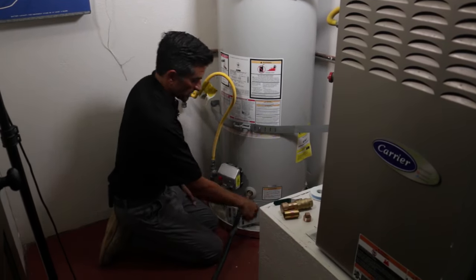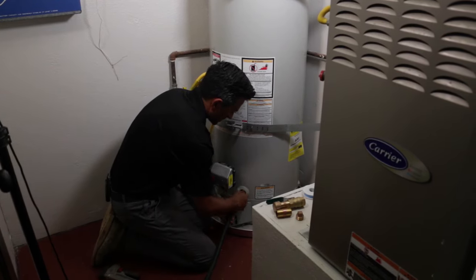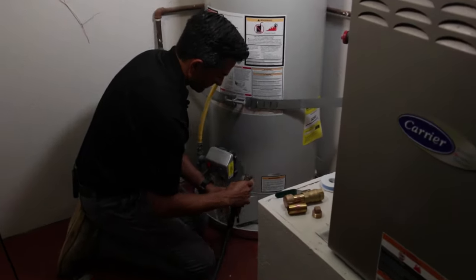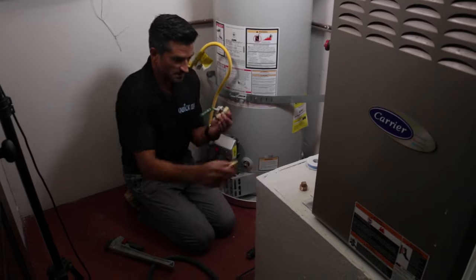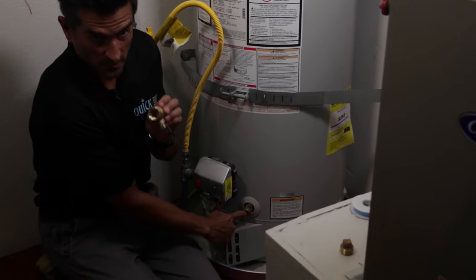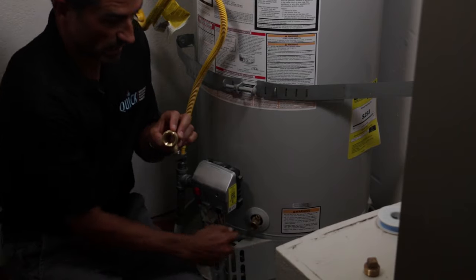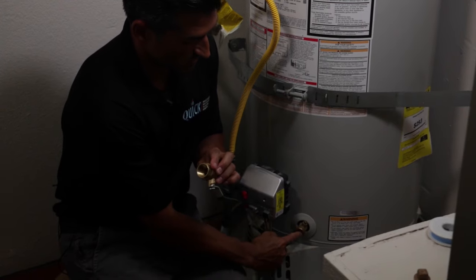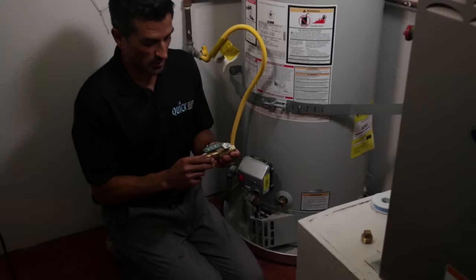There's no air being allowed in, so it won't drain. When I move this valve down here it'll just come off. I'll leave it open to verify we're not going to get any water - barely any water's coming out. Here's the most important thing: this new valve has a hole significantly larger, probably three to four times the size of the manufacturer's drain valve, so if anything's actually in the way it'll drain right out. What's happening currently is the hole's too small - there's probably a piece of sediment stuck in there that won't allow any water to get by.